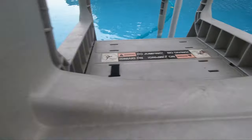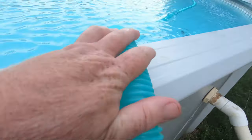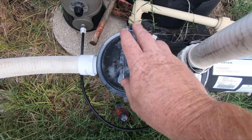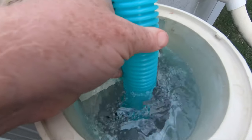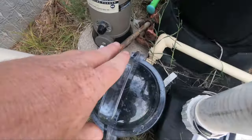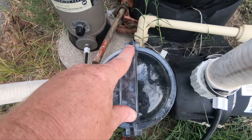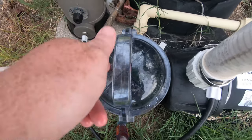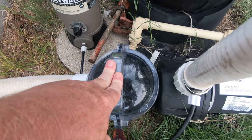Back to how to keep it moving — the second thing I would do is turn your pump off and remove this right here. You may just have too much stuff in here, because you're bypassing the skimmer and getting leaves, debris, and everything. When it gets in here and this gets full, it's going to not allow much suction. So keep this cleaned regularly, check it — it could be completely covered. Remove the strainer from inside here, clean it, put it back in, and you may be back in business.